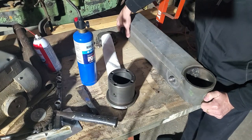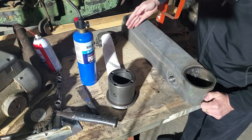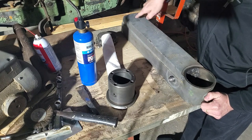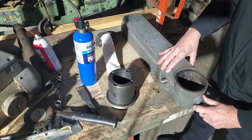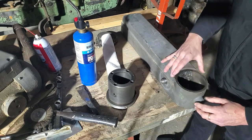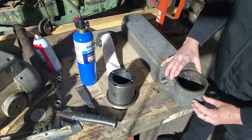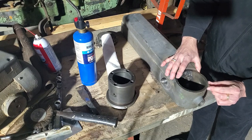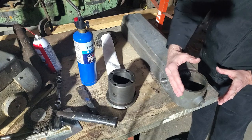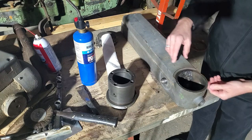I got some 6x6x3/4 angle. I'll cut a slice of that, and that'll give me a right angle mount here on the back. I'll gusset it. A short piece of 3 or 4 inch schedule 40 pipe, I think, would be sufficient. I'll scallop it, and I'll put another piece of pipe on the front. After I put this mounting boss on for the indexing pin, I'll probably have features over here with another split, and I'll clamp it from the front or from the side, and it'll serve the same purpose.